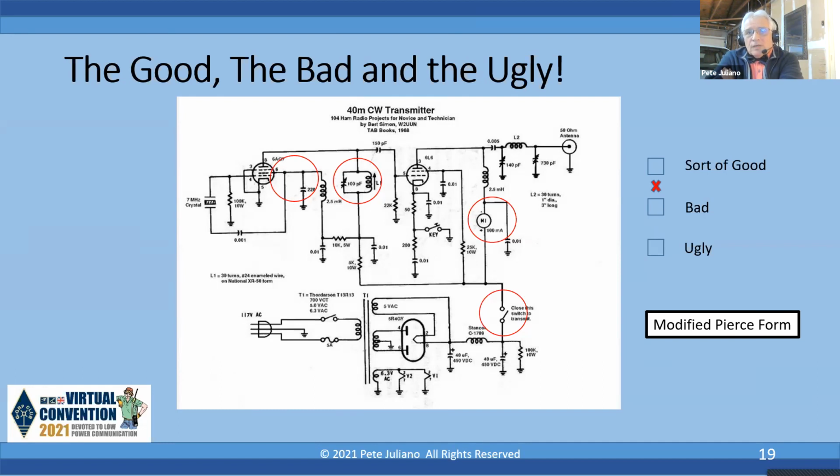So it'd be better to move that switch into the center tap return that's grounded on the transformer. And you'll see some of the circuits of the past put the switch there. Opening the switch opens the ground return, and closing the switch completes the circuit. So you've got the high voltage. That's a real problem. You could put a relay in there and control it with a separate switch, but the relay has to be rated the same way as the switch contacts. That's not a really good idea without designating what it has to be and what kind of voltages are on it. So just keep an eye on that.